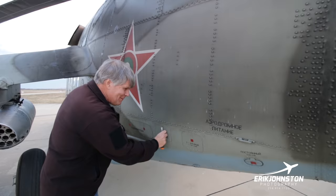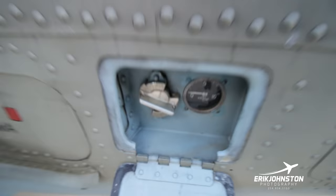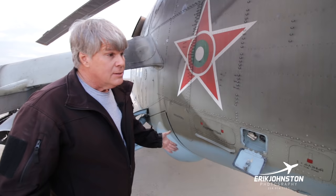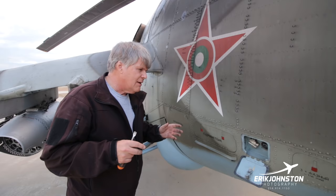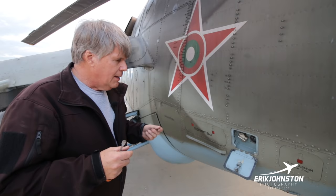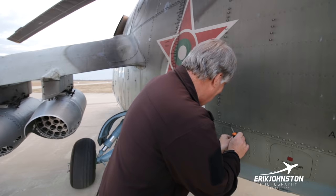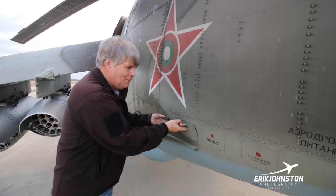So, where was I? This is air pressure, and presently it hasn't been running, so I don't have any air pressure here. Why would I need air pressure? Is this the air pressure we use to start the engines? No, this is the compressed air that we hold on board for the brakes. Pretty much all Soviet aircraft, with some exceptions, use pneumatic brakes. Some of the high speed stuff and some of the stuff operating in lower temperatures uses hydraulic. And again, this sounds like a truck. You pull the brake and let off, and hear this psst, sort of like a diesel truck. If we were taking off right now, I'd go get some nitrogen and put a little bit of air in.